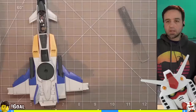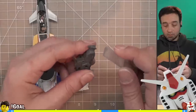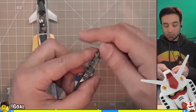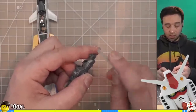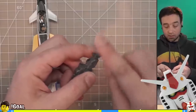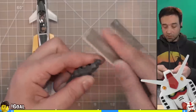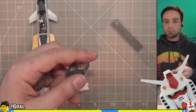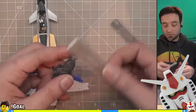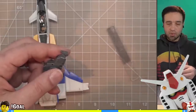You can definitely use glass files on round surfaces. You need to be mindful of putting flat spots on. On a curved surface you'll just do it like this. The lighter you are, the less gouging you'll get, but a little final finish at the end with a sponge can be useful. I just tend to use the sponges for finishing work, whereas I use the glass files for material removal.